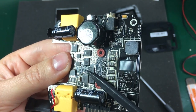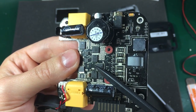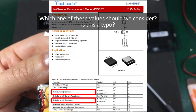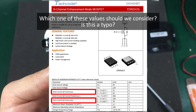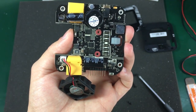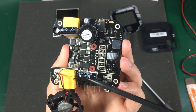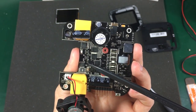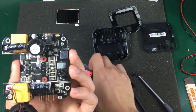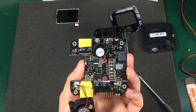All the PCBs are nicely laid out and routed, with nice soldering and no bodges that I could find. If we remove the heat sink we find the main switching MOSFETs and the resistors used to dissipate power when balancing a pack. There are 6 of them, which makes sense since this charger can do 6-cell balance — each resistor is switched through a small transistor on the corresponding cell to dissipate power and balance the cells. The MOSFETs are TDM3436s — N-channel MOSFETs with a 4 milliohm RDS_on. Not exceptionally good but pretty good for this application. I don't think they need anything better.